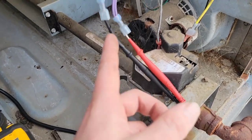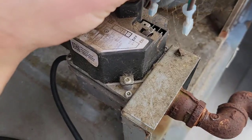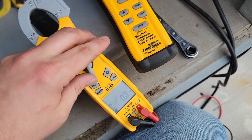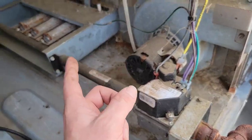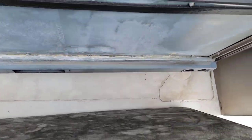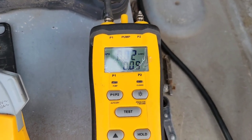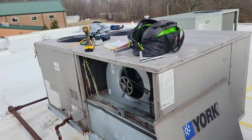We verified 24 volts, and I hooked those wires back up to the valve. We know there's 24 volts to that valve, and since it's sparking and sending power to the gas valve we've closed all the safeties. The gas valve is energized and we got zero pressure — that's not three and a half inches. So I know for sure the gas valve is bad. Now we're going to replace the gas valve, and then we'll move on to talking about sensors.